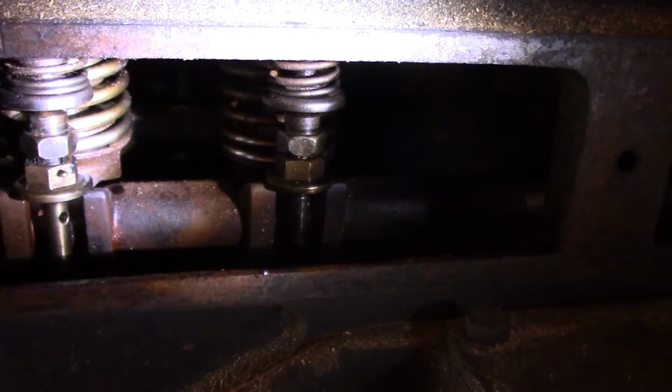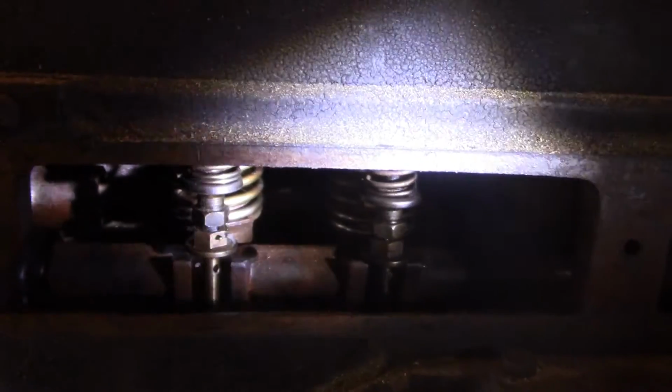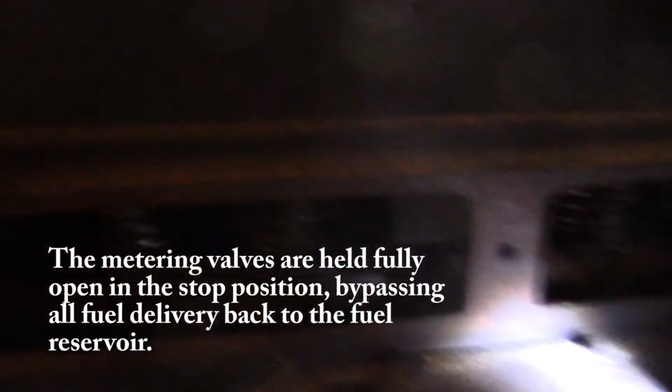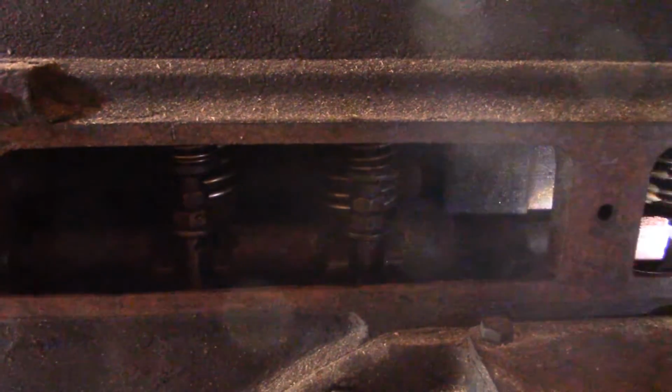That cylinder, number one, must be in position, or out of position right now. Why do you say that? Because, see, it's already being held open. Unless it's stuck open. Well, it's either being held open or partially open at the position it's in. Yeah. Because when they go that way, all the 3 others lift up, but that one's almost already lifted. And that's your stop position. Yep. It's just lifting the valves off and holding them all. Sure, no fuel. And of course, that way physically pushes the pumping side.